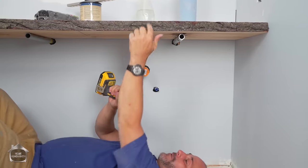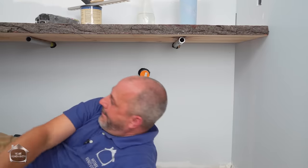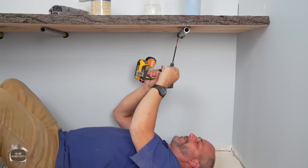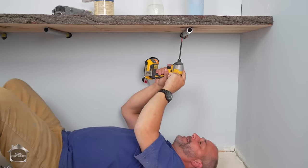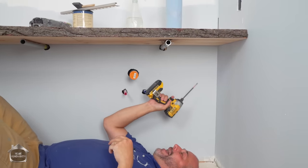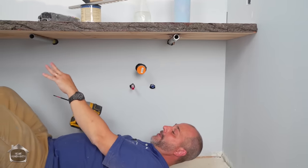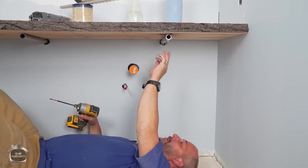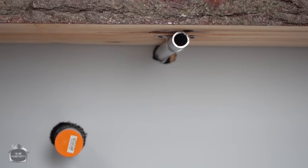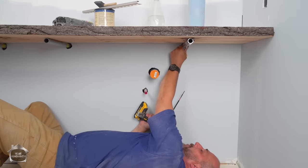And we're using an 1¼-inch screw. How thick is my wood? No problem. Okay, always good to double check. Make sure you're not gonna drill through the other side, because that would really be a bummer. Now, I'm gonna attach the clip at the front of this and the back of this, because there's an overhang. Because the counter is inconsistent, we cut short on purpose, and there's an overhang. So we want to attach the front and the back on the two outside pipes, and the one in the middle, it doesn't need to be attached. It's really irrelevant. It's just there to help support the weight.